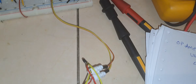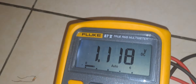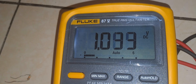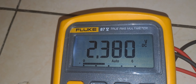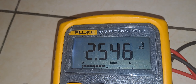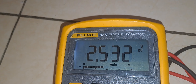Now I am going to heat the sensor. As you can see, I am heating the sensor and the voltage is increasing. As I am heating the sensor — the sensor is in the deep flame under a candle — you can see the voltage is increasing. The millivolts of the thermocouple is multiplied 100 times; I have a gain of 100 in the amplifier. This is the 100 times amplified output voltage — a quite measurable voltage. This voltage is fed to the unity gain buffer and we are reading the output of the unity gain buffer.